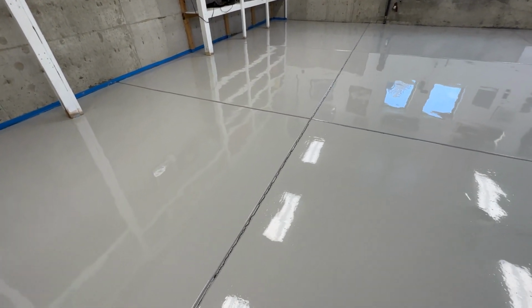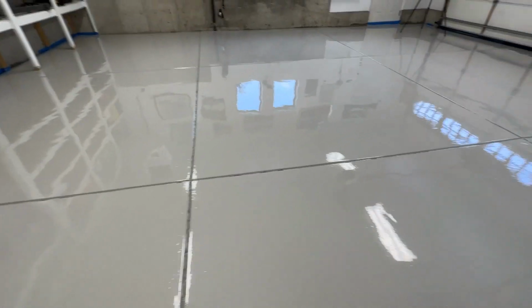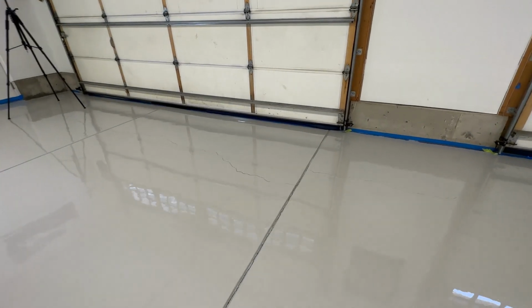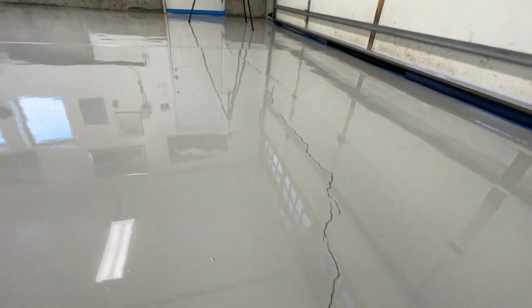Second, you got these gaps over here. You can kind of see I got some cracks down there. They don't bother me because, again, I'm looking for something that's brighter and just resists all the kind of the chemicals that get on the floor. And this doesn't bother me, but you can fill this in with some product. And also there's some cracks over here in the concrete. You can see that this product does not fill those cracks, and you could, again, fix that by just spending a little more time filling this in with some kind of a compound before you go to putting the epoxy down. Okay, I couldn't be more happy with the finished product over here.